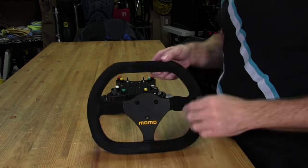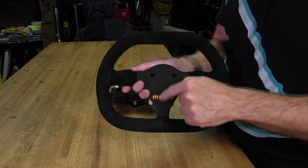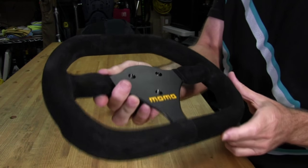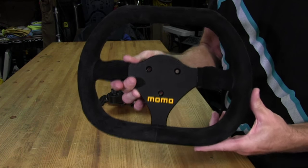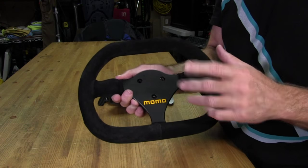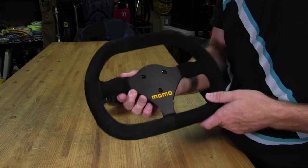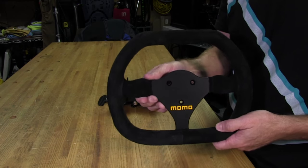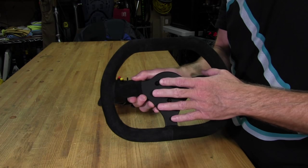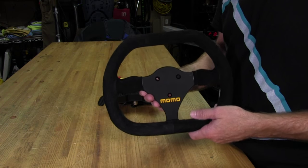Right, now we've got the countersink holes painted black, so it won't be able to see the shiny aluminum. And I'll show you what I did there. It's actually supposed to be a semi-gloss black, but it is paint. And paint and aluminum usually don't go very well. They just don't mix very well. That's why they anodize aluminum a lot. Paint just doesn't want to stick to aluminum, and if you do paint it, it comes off pretty easily. This has been drying for a couple of days, and I'm really just going to be putting the screws on one time. Once I get it all together, there's no reason to take it back apart again.